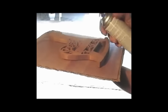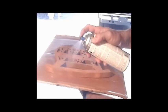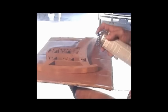As I'm sealing wood, I always use low angles and spray lightly so that the spray will make it to the inside cuts and yet not build up on the exterior. Then I'll spray the edges of the piece, and then finally, I'll spray the face of the piece along the grain from top to bottom. I'll set it aside at that point and then use the same process for each piece.